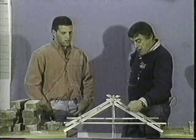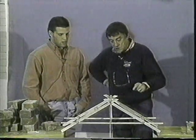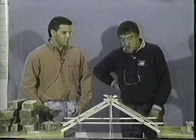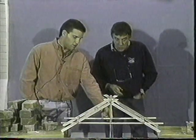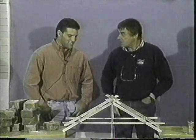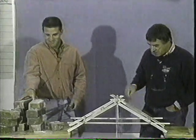This member would have a neutral axis, just like many members that bend — going into compression and tension, so in the middle they're neither one nor the other. But that's rather a lot you've taken out there. What that might do is cause the material to shear along that point where it makes that bend, whereas if that was string it would have been fine. Hindsight's 20/20 vision — let's see what happens as we load the thing.